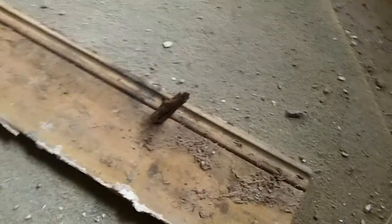That plaster has been taken off everywhere else on the external walls — you can see around here all the walls have been stripped off, and they're pretty well bone dry now, except where we've just taken this skirting off, and that bit of wall isn't able to breathe.